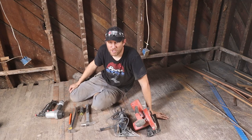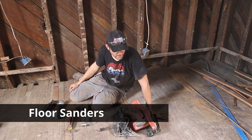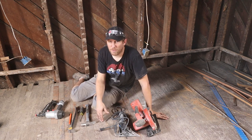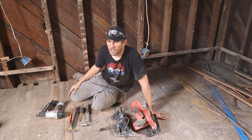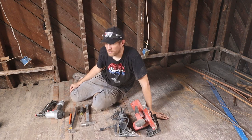One thing you just won't get around is sanding the entire floor. You will have to sand the entire floor to match the stain and match everything that you have. Most likely you took the flooring from somewhere else in the house, found something online that matched closely, or maybe even purchased new flooring that matched. Keep in mind, if a floor has been in a room for a while, the sun changes the color, so sanding the floor, all of it, matching the colors, and then staining it if you had it stained before, or refinishing it